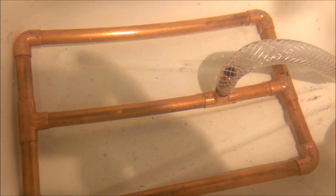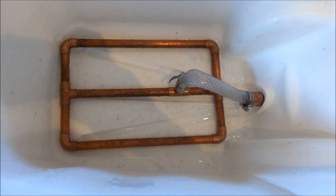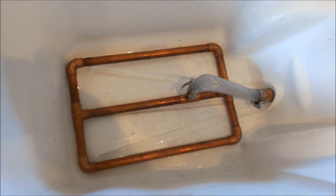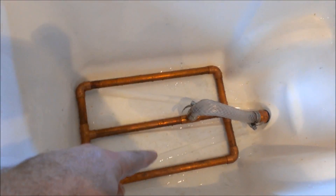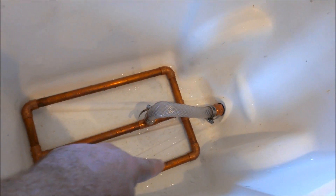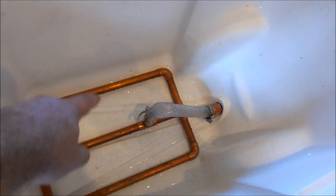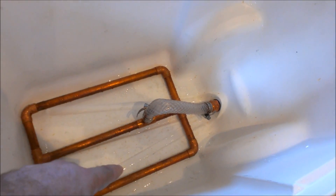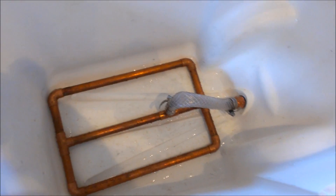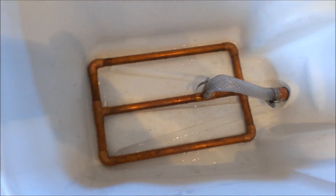The next day I took everything apart and cleaned it with a good stiff pipe brush after putting the notches in the bottom of the copper piping. You want an equal number of notches throughout — not 15 over here and only 10 over there — so all the wort flows out evenly and you don't get a hot spot or uneven sugar extraction. I made sure the holes are really even and got everything clamped down.